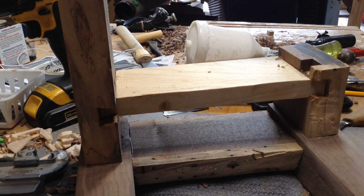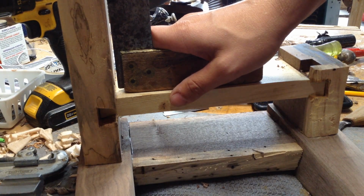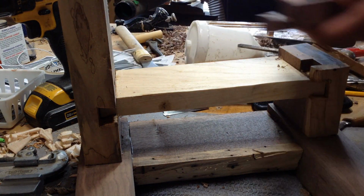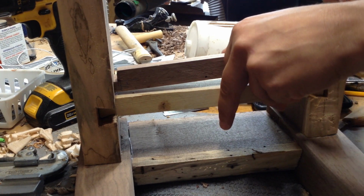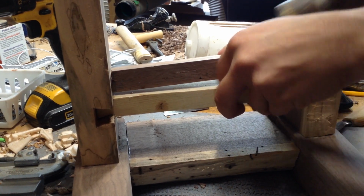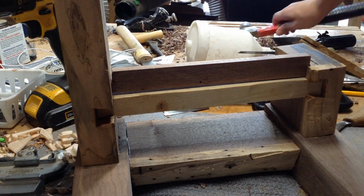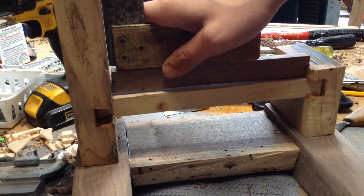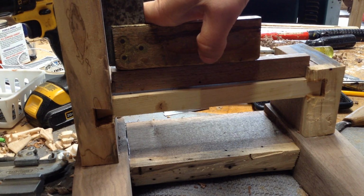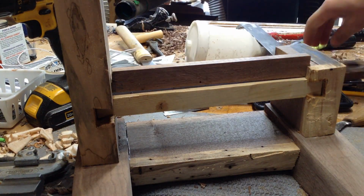It's cheated off that unsquare piece of dovetail just enough so that now this is perfectly square. You could see beforehand it's off by, it's actually a little less than an 1/8. And then when I put my piece in, which is a nice tight fit, you'll see that that's now squared up. So then I'm going to have to go through and recut these, so everything's nice and square, which means the drawer should ride in here quite well.